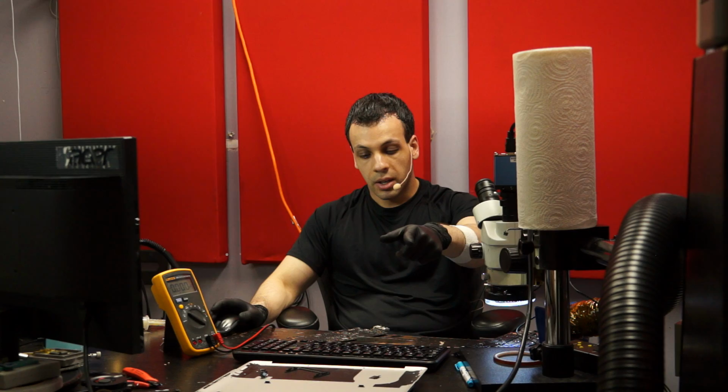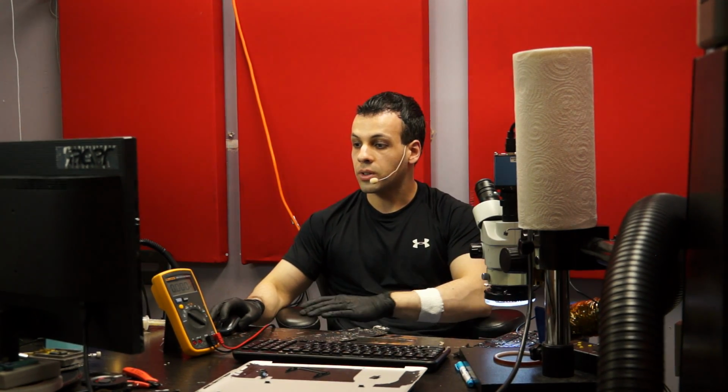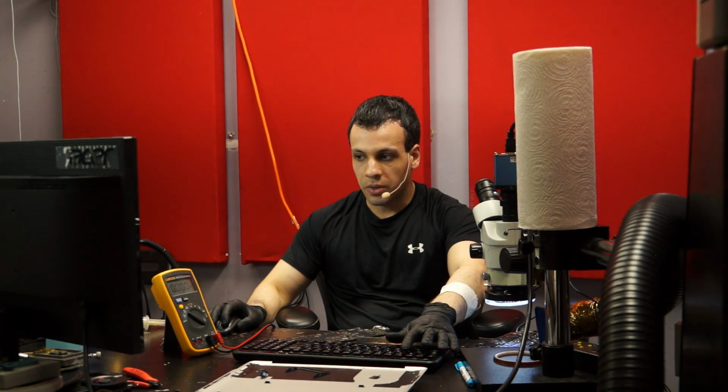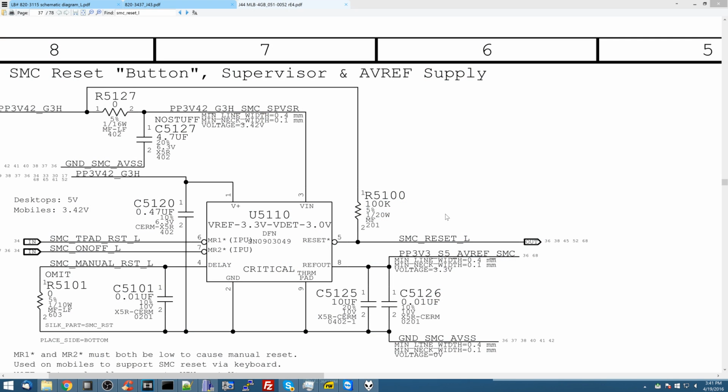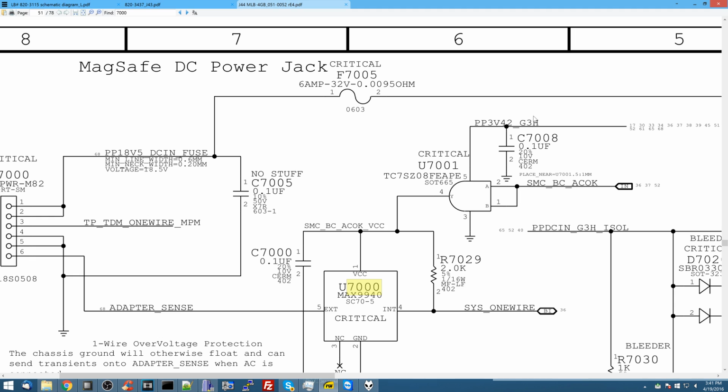By the way, if you don't know what the one-wire circuit is and you want to understand this video, watch the one-wire circuit videos. It's short, it's simple. I try to not ramble, which is a challenge if you're me. Let's just go over that. The first thing that I need for the one-wire circuit to work at the beginning is PP3V42, right? So I measure that PP3V42 is present.